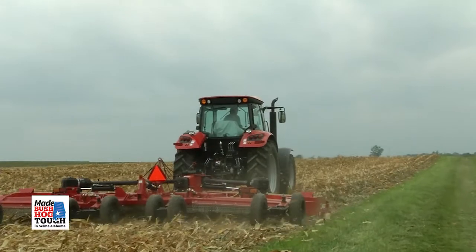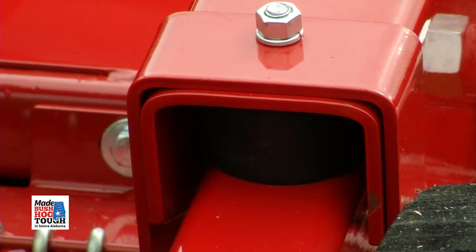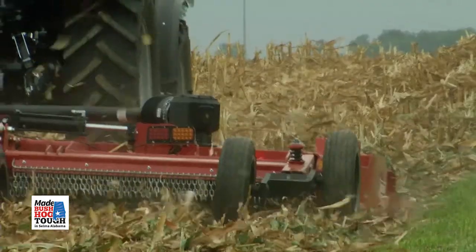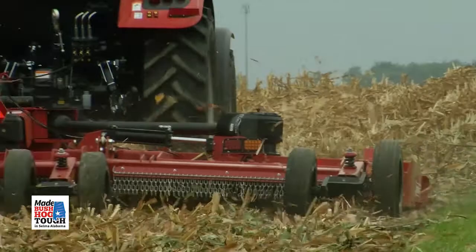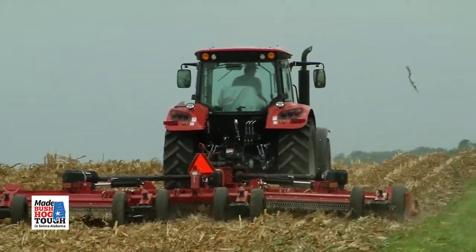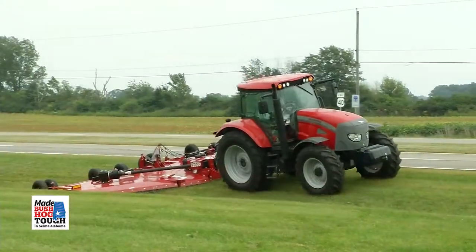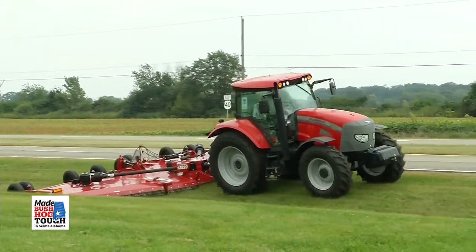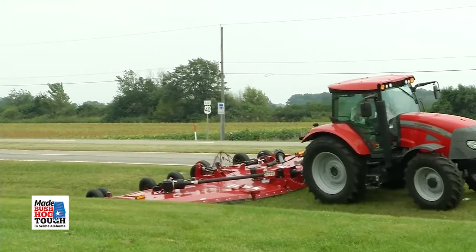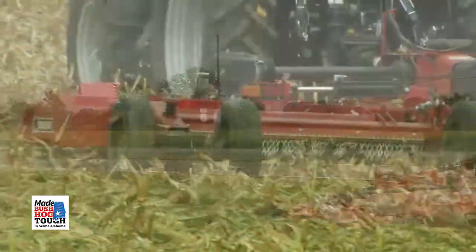Blade pans are reinforced for maximum durability, and spring axle cushions are located near each wheel for maximum shock absorption. Grease fittings and spring steel bushings for maximum wear are at each pivot point. Wing skids are formed upward at 45 degrees to prevent dig-in on turns that might otherwise damage the side band. The center section has a double deck with no exposed structure for smooth flow of cut material.